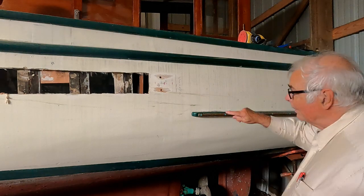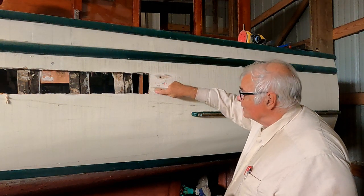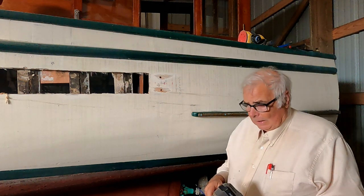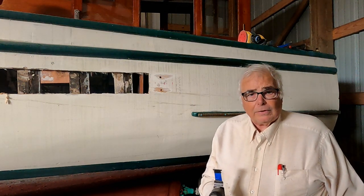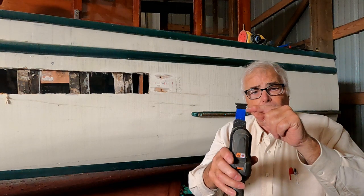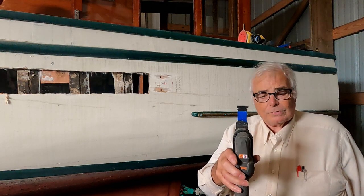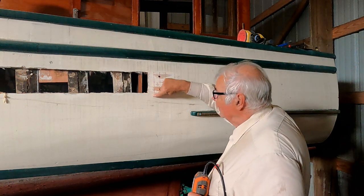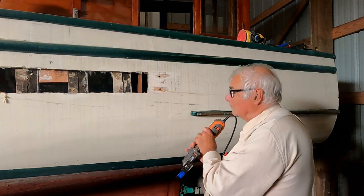The first thing I'm going to do is make my vertical guide cuts here to three-fourths the thickness of the plank, half the thickness of the plank, and a quarter of the thickness of the plank. In order to facilitate that, I will make all the three-quarters cuts first, and I have taped my blade so that I just cut until the blade is embedded in the wood up to the tape. This is 21/32 of an inch, which is three-quarters of seven-eighths. The cut line closest to the area where the plank has been removed is the one that goes to three-quarters — time to make that cut.